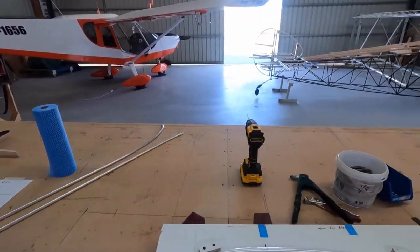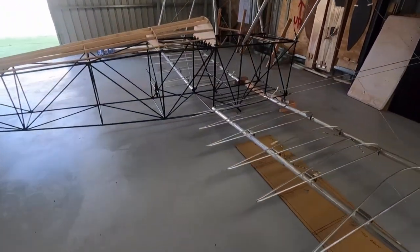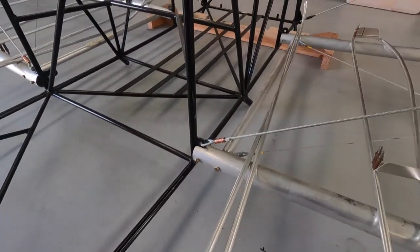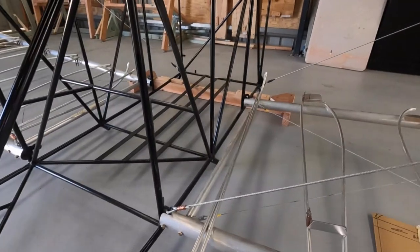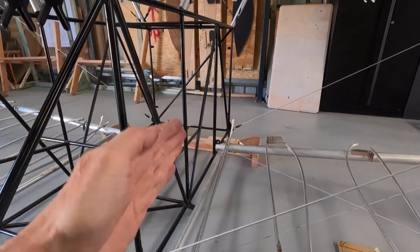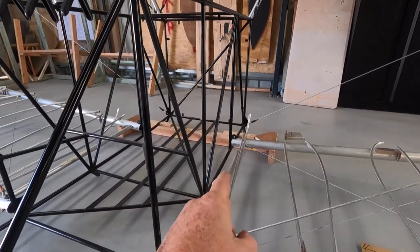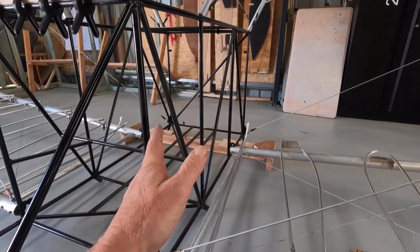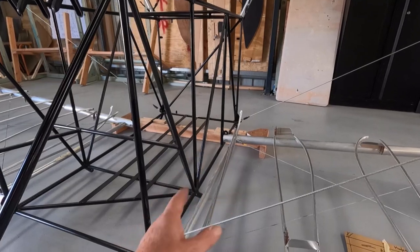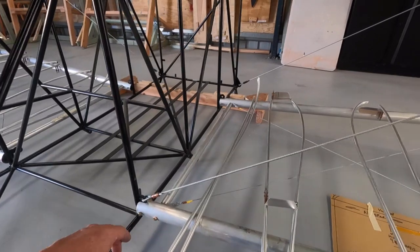One more rib to go — well actually three more to go. I've allocated the root rib but I haven't built it yet. I'm going to do a bit more research on the root rib. I think I need a cardboard template of the fuselage side first so I know where I'm going. I think the leading edge bolt actually ends up on the inside of the fuselage, and then you've got cross-bracing and the trailing edge.